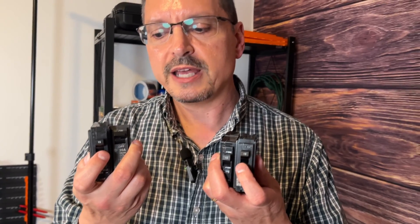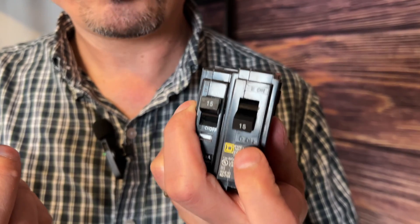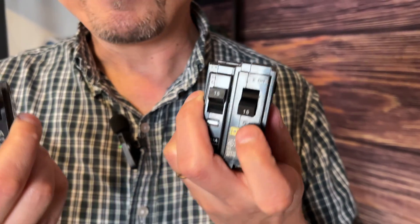The total amperage on your circuit breakers — all these are is a maximum. If your circuit hits the maximum, say 15 or 20, it will trip and turn off the circuit, protecting the wiring from overheating, causing a fire, causing damage. It's not designed to react quickly enough to protect you, the user, from a shock. That's what grounding, GFIs, and other safety devices are for.